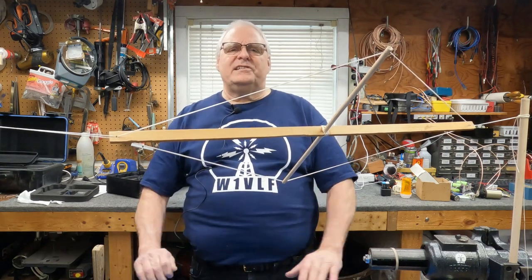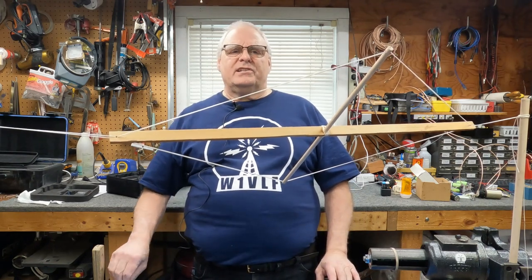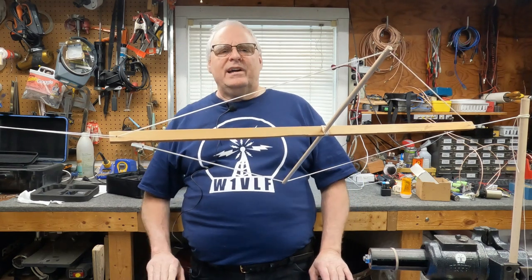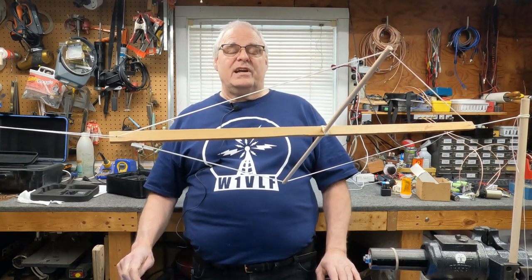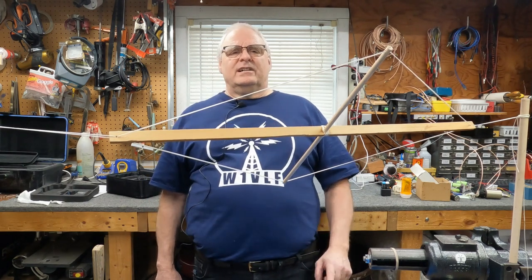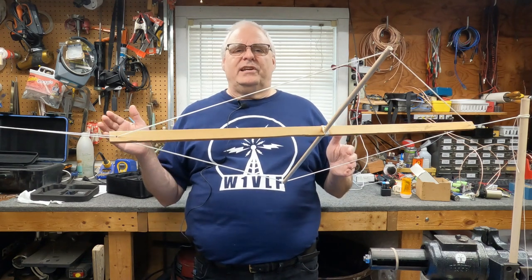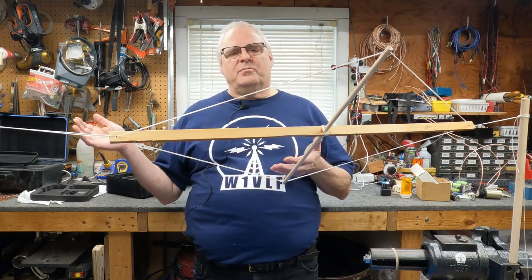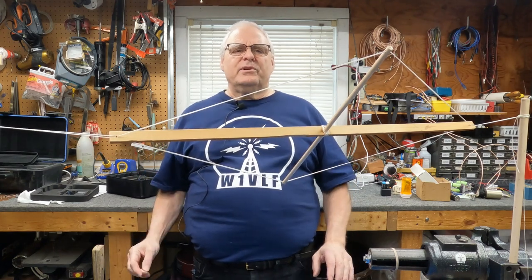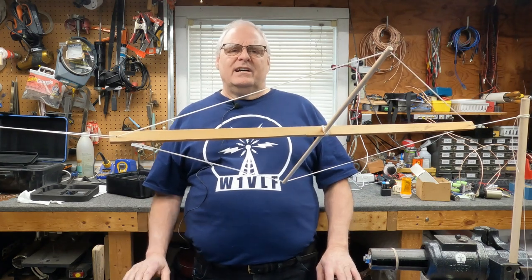You know, who has an SCA on, who has the RDS going, who's broadcasting in stereo, who has the pilot, and why, and who has the double sideband 38 kilohertz, and why the phasing is so important from that 19 kilohertz pilot doubled to 38 kilohertz, and then you have your double sideband, and there's a phase relationship between those two, sort of like what we were doing with the MFJ box and SDR Uno, but on an older scale.